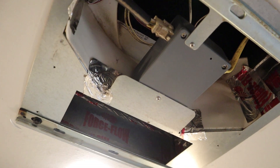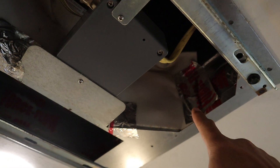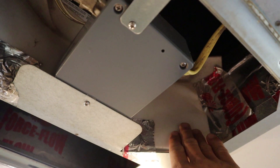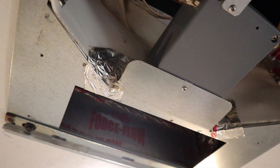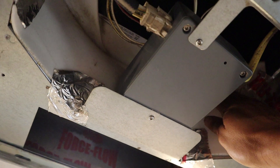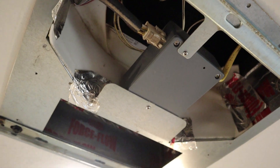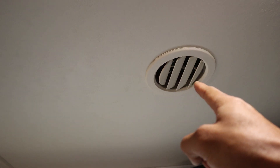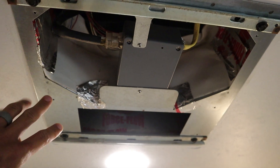With the faceplate off, you've got your AC dump side where the cold air should be coming out, and you've got your return air return on this side. You can see where they've put up some foam sheeting to insulate that barrier, but I'm putting my hand up here and I can feel cold air coming out. The reason there's cold air coming out is because our second AC unit is on and it's ducted. That is a lot of wasted cold air — it's not getting pushed out through the vents, it's just being recycled and not being very efficient.